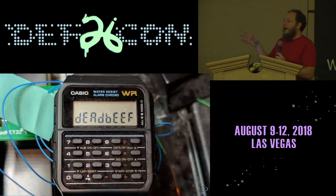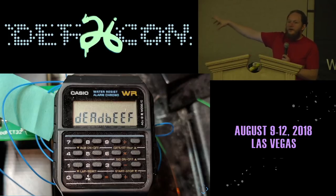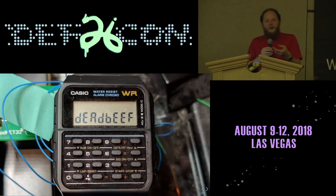I initially bootstrapped it by building a watch that has these little blue flywires coming out of it for reflashing. This also allows me to read back the dmesg log from the watch. And I use this for all of my software development so that as I'm developing the code, I'm doing it on a tethered watch where temporarily I have no power concerns and where I get full logging.